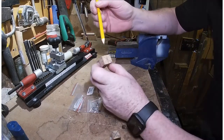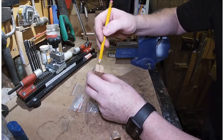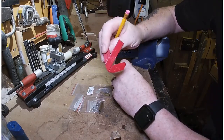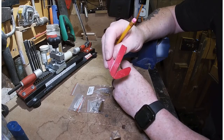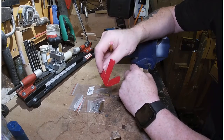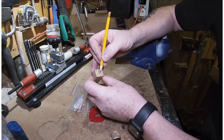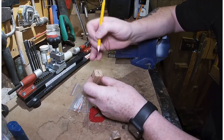So even though this is not square, if you do it off of all sides with one of these little devices that you can get off of Amazon, eBay or anywhere like that, I think Axminster do centre finders as well, and so you go off of all sides, and it looks like you just got lines everywhere, but actually gives you a little bit of a heads up of where the centre is there.